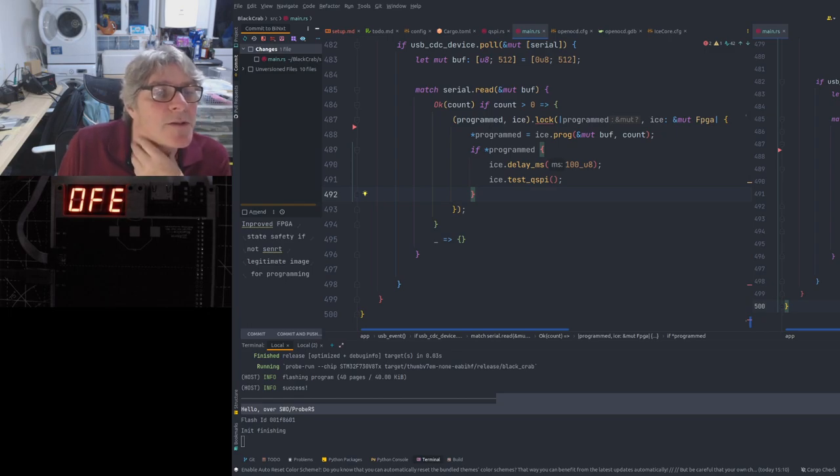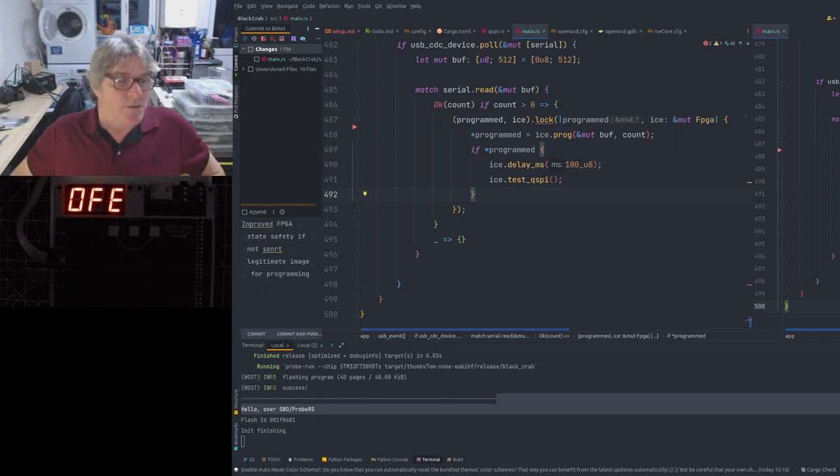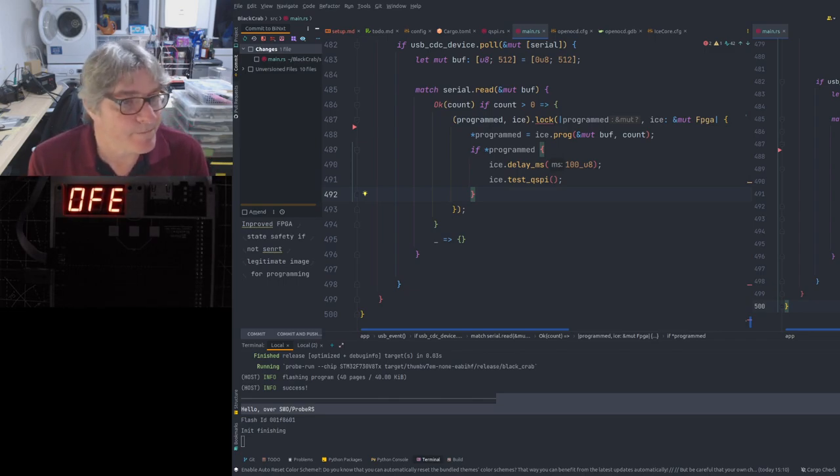Yeah, Owl London also says, I'd say even if not a tile, as a module. But you may as well do it as a tile. The good thing about doing it as a tile is you've got direct access into the power bus of the ILB, as well as all the control signals. So you get some good benefits by putting it on a tile rather than just doing it externally.